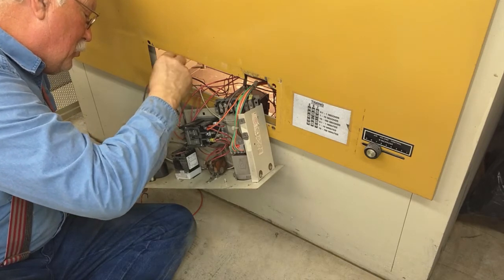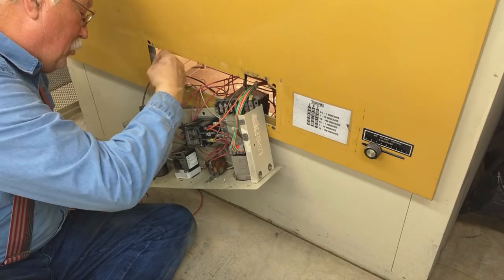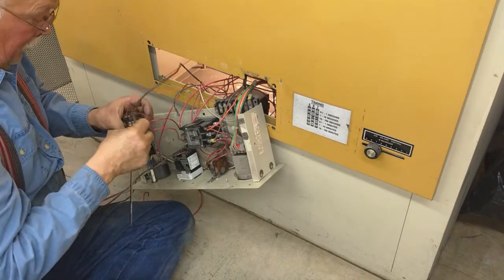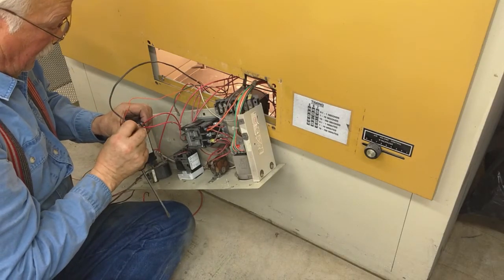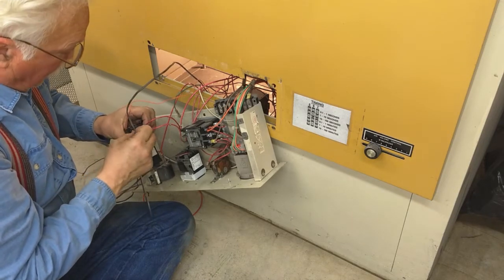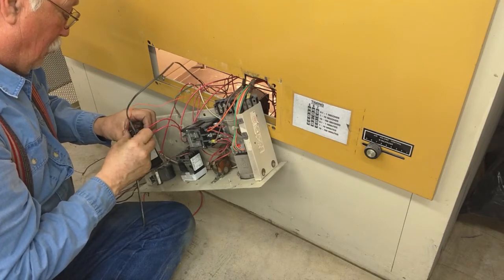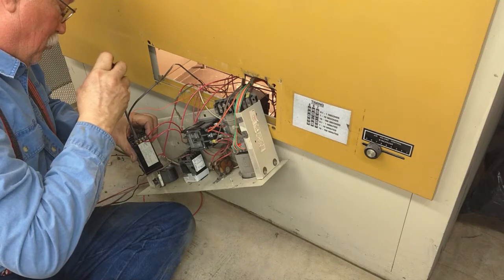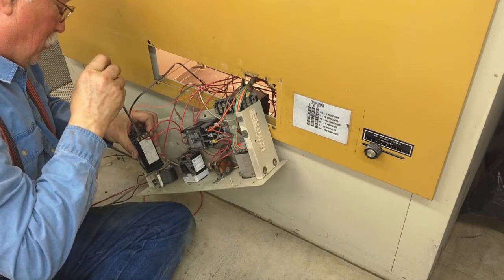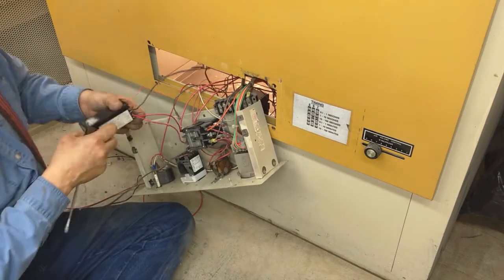The original temperature controller was a Syscon, that's S-Y-S-C-O-N, Rex-C100, that's R-E-X-C100. Now there's a lot of Rex-C100s out on eBay for like 14 bucks, and that includes a K-type thermocouple. If I do a search on a Syscon Rex-C100, they're upwards to $300.